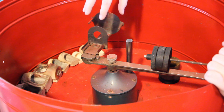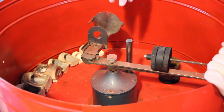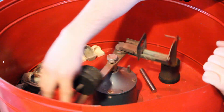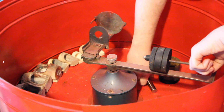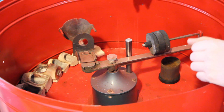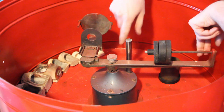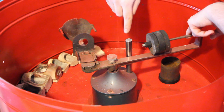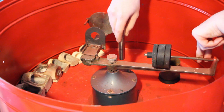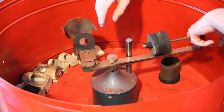This machine itself requires no electricity — that's one of the big upsides — it's all spring loaded. This bar comes out; this is kind of the lock, and this gets wound up. I'm not going to wind it all the way because it's a bit violent and we don't have anything in it to balance it. This is actually a lock I had to make for this, because in my experience with these machines, the little button lock thing down here is the first thing that always breaks. So I just drilled a hole in the bottom and this holds it from going back.